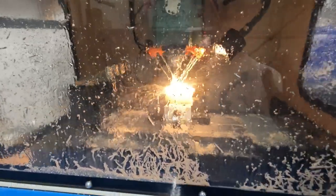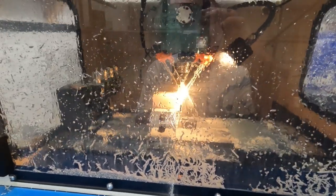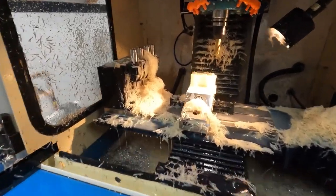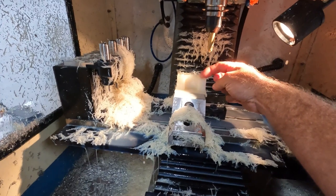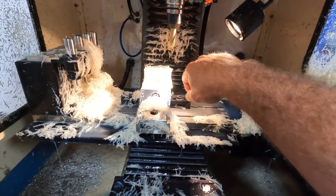When it's done cutting we'll come back to see the bulk of the mess it leaves. Sorry you can't see it well, but the coolant gets splattered all over. It doesn't work well without coolant. The machine has spooled down, the pump has shut off, and that's what the part looks like. The plastic leaves a thin film on it, but the rest is nice, clean, and super smooth.